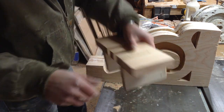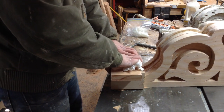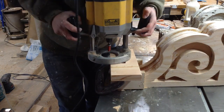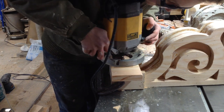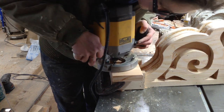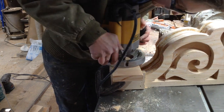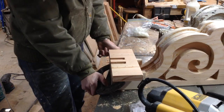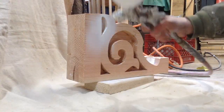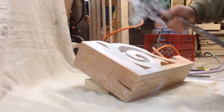I clamped them together and let all of them dry. This is the quick jig I made - once these were all together, I just made this on the table saw real quick, put two pieces of plywood on the edges so I could clamp it in place, and then route those two little notches out of the front. Now this is all one piece - this isn't an added piece that could fall off. These were also old enough that the originals didn't have any glue, and if they did the glue wouldn't have been great. Now that we have stuff like Titebond 3, which is rated for exterior use, these will last a really long time.